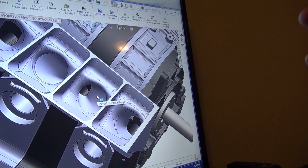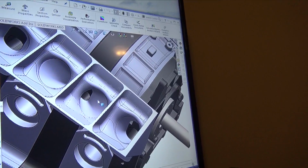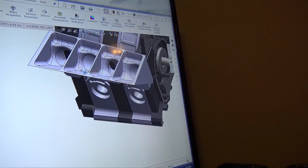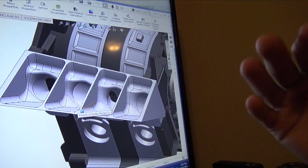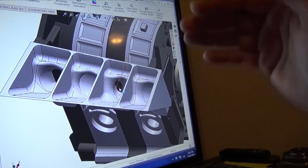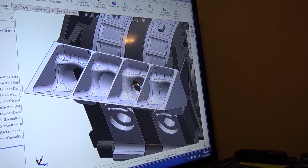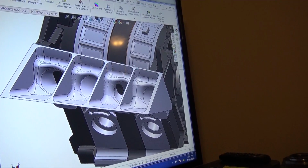But a lot of the Formula One cars, a lot of high performance, high horsepower cars, if you can do it, putting the injectors inside the manifold is a very, very beneficial idea, because they are directly in the ports. These are the secondary injectors. So the good thing about those is they only open once this thing is getting into the upper RPMs. But with them being directly pointed at each port, the fuel is going to be just really atomized. It's going to go directly into the port. I mean, it's just going to be really, really good. That will eliminate me from having these fuel rail constraints over here.